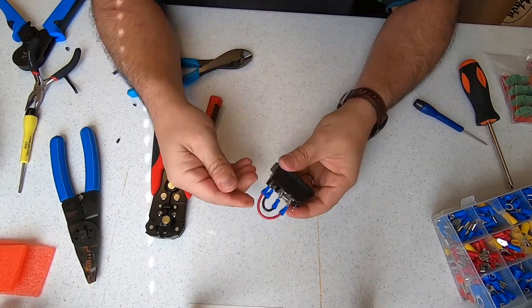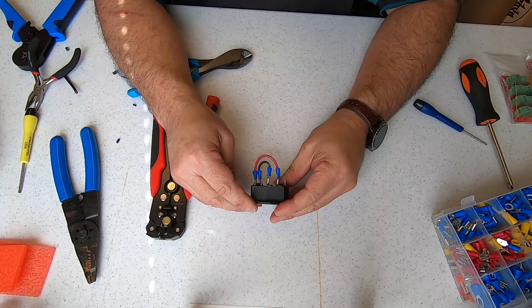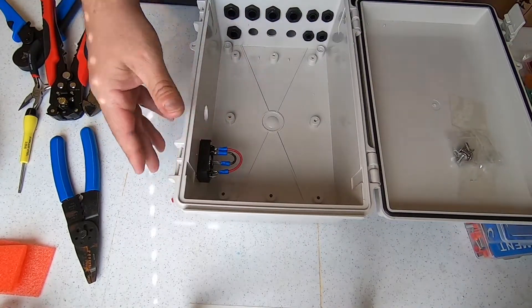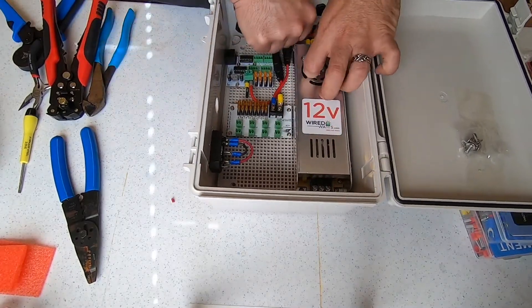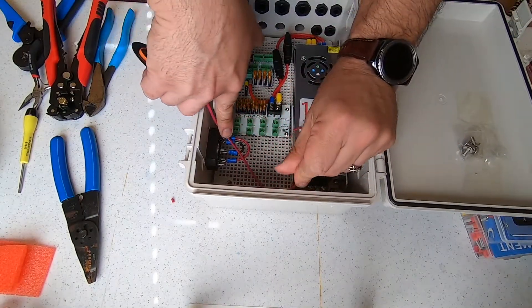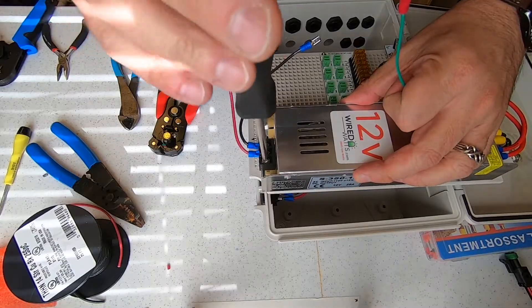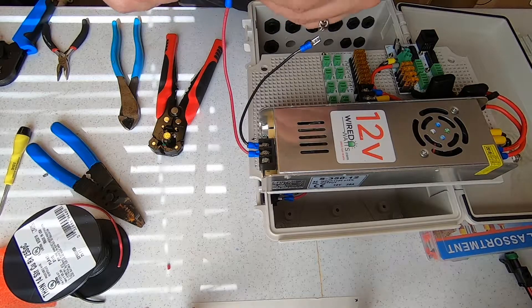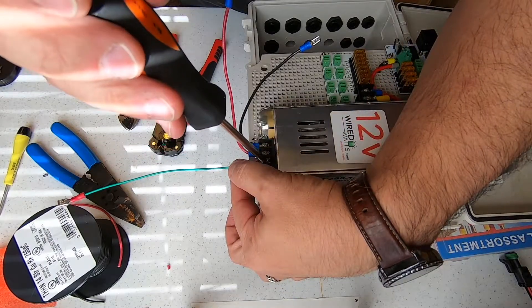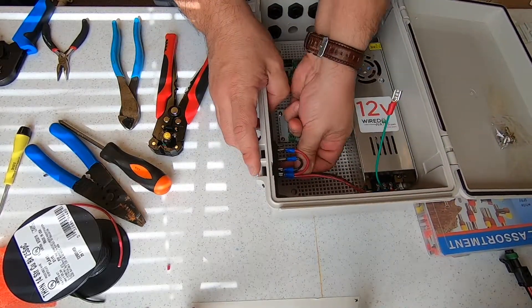Next, we will need to wire up the switch. Here is a nice wiring diagram I found on Instructables — I'll link it in the description below. We'll need to create two jumpers from the line side to the load side on the switch. Cut a black and a red wire to fit for your jumpers and attach a female spade terminal to both ends. Attach the black wire to the inner connectors and the red wire to the outer connectors. Now we are ready to install the switch into the box. Install the switch and make sure that it fits snugly. Next, insert the backing board with the power supply and the components. Measure your wiring so that it reaches from the power supply to your switch. Wire up the red wire to the L (the line or hot side), the black wire to the N (the neutral side), and the green wire to ground. On the switch side, connect the black, the red, and the green wire to the switch.